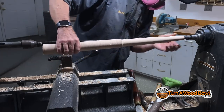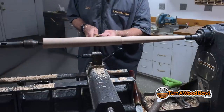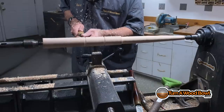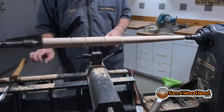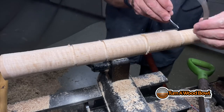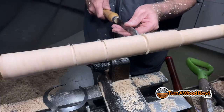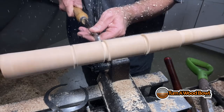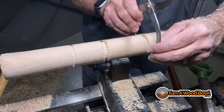We'll continue the turning. Because we're end-to-end, on the headstock end I'm using a cup drive — it's a disc cup with no spurs, so it's not gripping into the wood and forcing the piece. If I get a catch, the wood will just spin for a second. I'm also using a live center on the tailstock. I can easily flip this end-to-end. I'm creating some more points to establish my depth so I don't accidentally turn an area too narrow — I want a nice evenly thick handle all the way down.